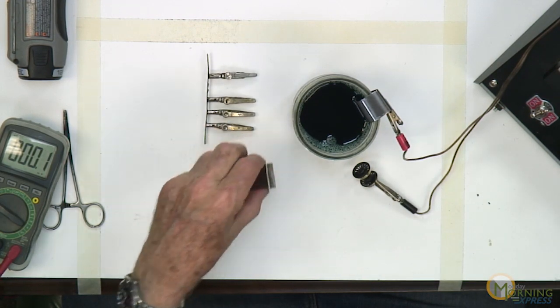Here is an old anode. This is actually stainless steel, and stainless steel has nickel in it. This one is pretty well used up — a lot of nickel out of it. So I've got a brand new nickel anode, never been used — I think I paid about $10 for it. The solution is $20–25. It's cyanide-free. The stuff I used 20 years ago had cyanide in it and it said it causes death in seconds, so I always kept it under lock and key.